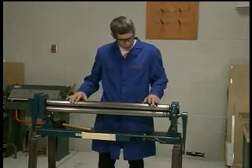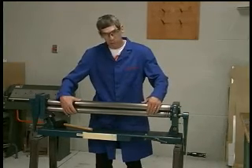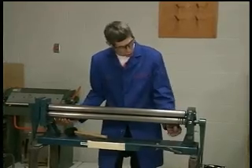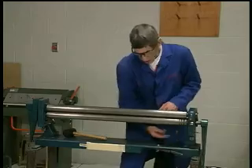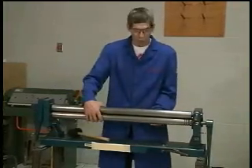As I mentioned, the forward rollers are adjusted for clamping pressure onto a scrap piece of material with these two screws on either side, which are adjusted to lower or raise the lower roller to clamp on the material. It will have to be adjusted for the thickness of the material that you have and your clamping pressure.